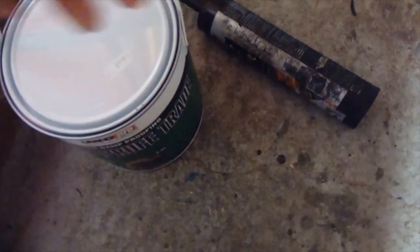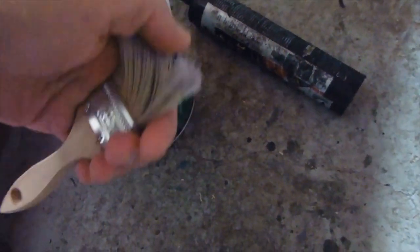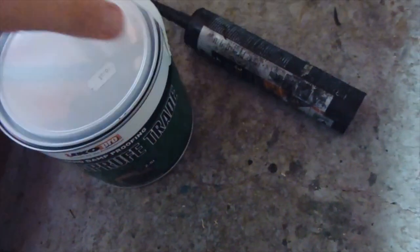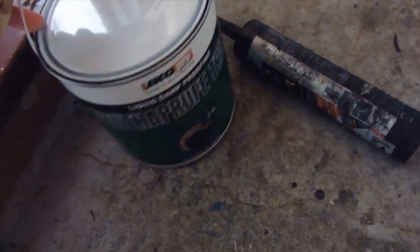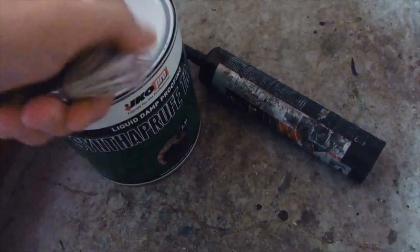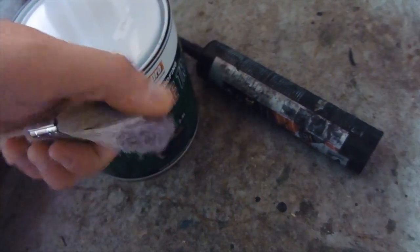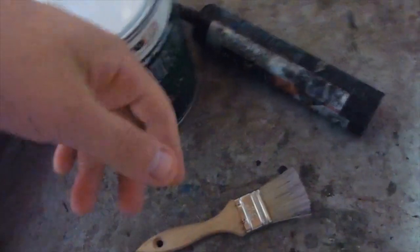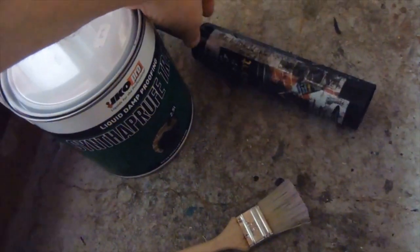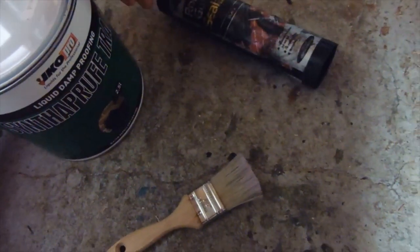The tools you'll need for repairing or maintaining your felt roof: first of all you'll just want a cheap brush. Don't use a roller because a lot of these paints have solvents in and it will just melt it - a roller is a synthetic material. Make sure it's a cheap brush like this one, because after you've finished you'll probably just throw the brush away as it will be really gunked up. A small brush is good for going along the lines and joins of the felt.